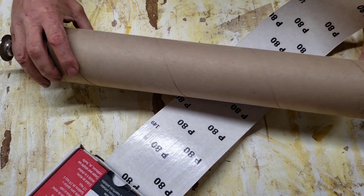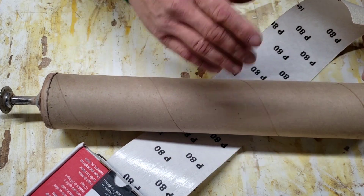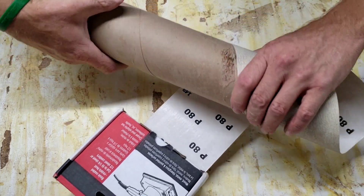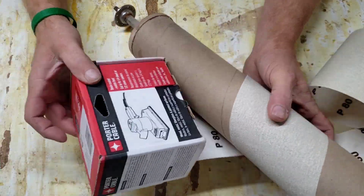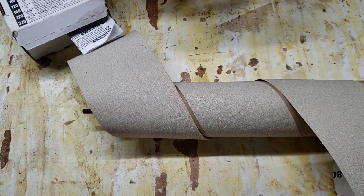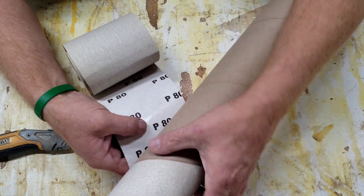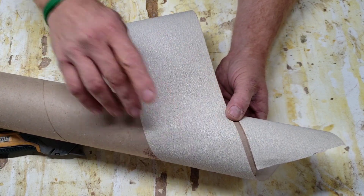Next step is laying out how much sandpaper I'm going to need. It's pretty convenient that this cardboard tube has some lines in it where it was rolled and laminated, and the sandpaper lines up really, really good — gives me a pretty good direction. I'll start right at the edge and basically loosely wrap this so I can get my line. This is a pressure-sensitive adhesive, so the harder you press the tighter and more adhesive it gets. First part's the most important — I've made one revolution but I've left myself about a quarter-inch gap, so I need to adjust my paper.